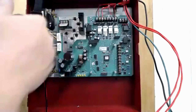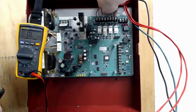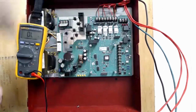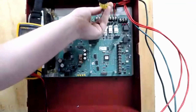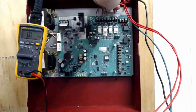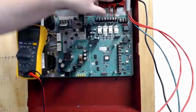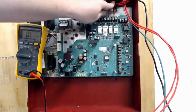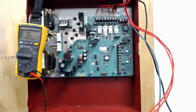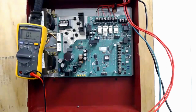Also, doing this helps protect the panel, because if we see shorts or something else, that could be an indicator that there's some kind of voltage crossed over on this circuit that shouldn't be there, and that can keep us from damaging our stuff. So we can also fix that problem before we apply power to it, instead of sending power back into the panel. So there's our 4 NAC circuits. They're now trimmed out, landed on the panel. This right here is a bit long. I could cut those back and make it a little prettier, but this is the gist of it.